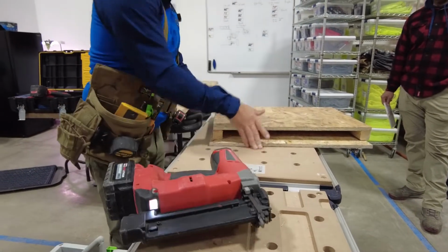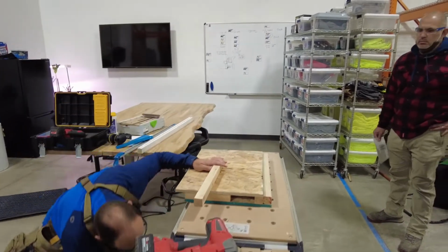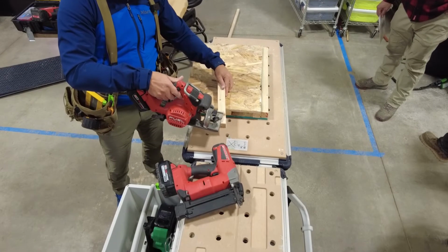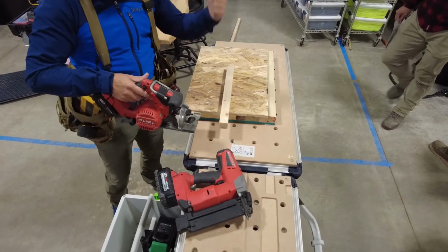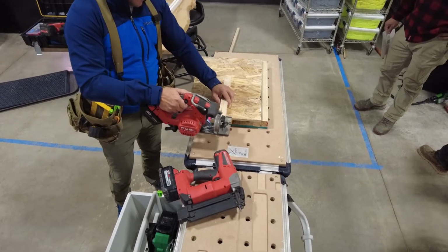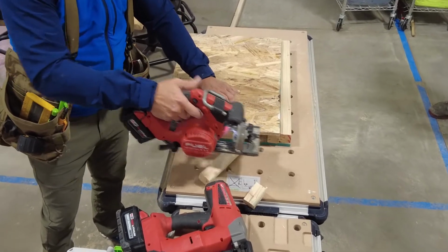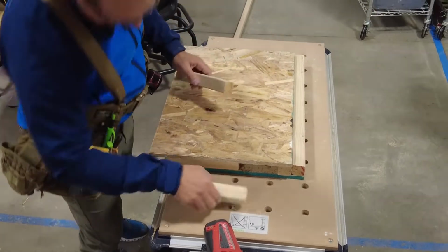That one just happened to work out just fine. Again here. Earlier you saw me hold that board up like that and cut it. Never do that, okay? Knots are super hard. That's where the tree's branch goes outside the tree. Cut them off, don't use them. Whatever you do, just don't nail through them, okay? All right.